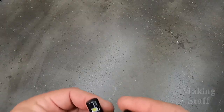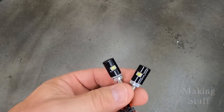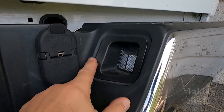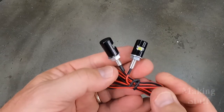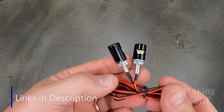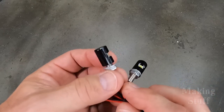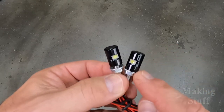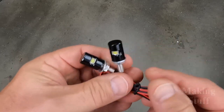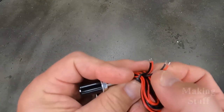I need to do something about the license plate lights, and I don't plan on reusing the light assembly from the stock bumper. Instead, I'm going to use license plate post lights — I'll have a link in the description. You just run the wires and the light through the bolt hole on the license plate and the bumper; this holds the license plate in place and also illuminates the plate. The only thing I have to do is splice these into the wiring harness on the truck.